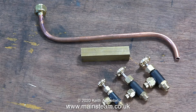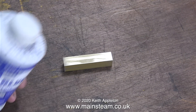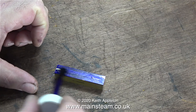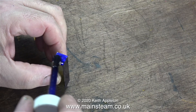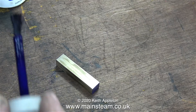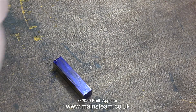I have a kit of parts. It's time to mark out the positions for the valves on the piece of brass. I'm going to use some marking out blue, kindly sent to me by a viewer called Norman. The idea is you paint it on the metal parts — it dries very quickly — then you can scribe lines that you can actually see. I've turned the part over so you can see the marking out blue drying as the solvent evaporates, and in no time at all it's ready for use.